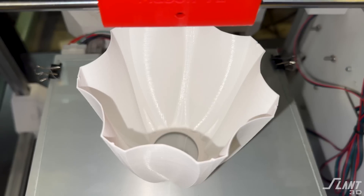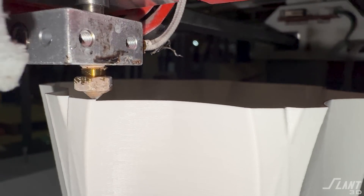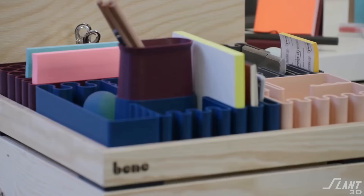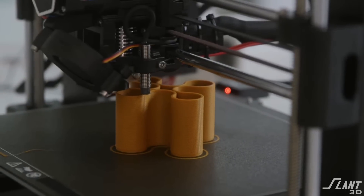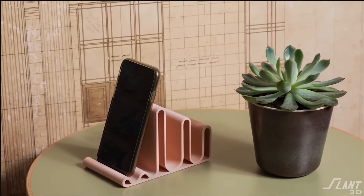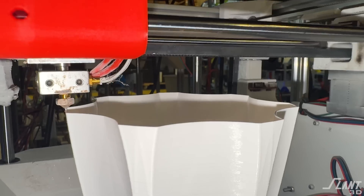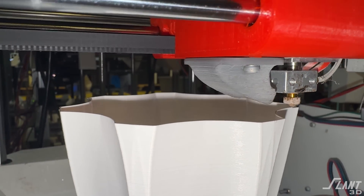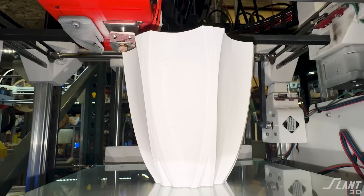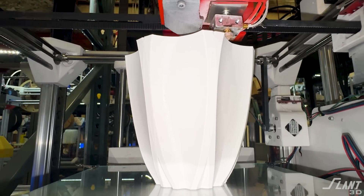When we looked at this project we thought, how about we use vase mode? Vase mode is a challenging way of producing parts because it requires design expertise in and of itself. We've talked about the BeFriends line created by Binet to show how vase mode products could be premium and really unique but still structural. Vase mode takes the outer contours of whatever the 3D model is and just does a single outline — very material efficient, very lightweight, and very fast to produce.